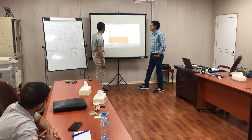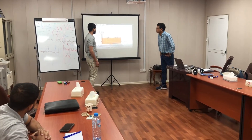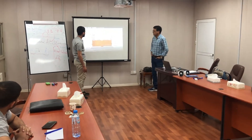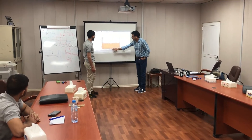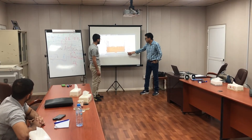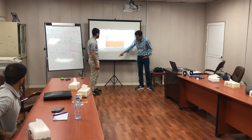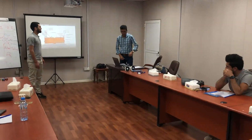This component is the venting, and also maybe the breathing. This is the center zone, and it has two drain sumps. One of them is for water drain and the other for product drain. The water drain is located at a lower level than the oil drain.